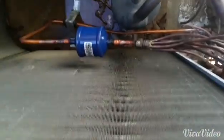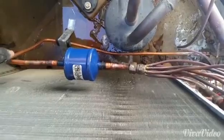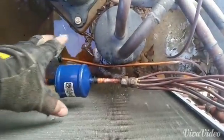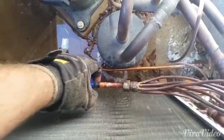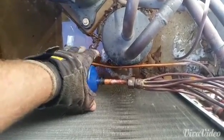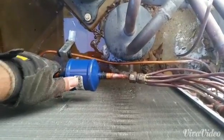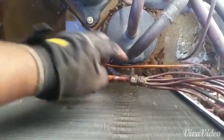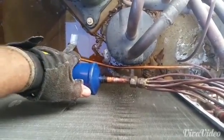So what I did was I re-engineered this. I have it running laterally to the dryer, then down with a brace on it, then back out. So anytime you want to change the dryer you just take the top off the unit and you can reach it right there, which is a whole lot better than the way they had it before. And I have a brace on it to isolate vibration a little bit because it was a long run going back around there.